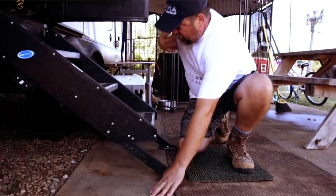Today let's talk about a serious situation we call hot skin. Hot skin is not what you think it is. Hot skin is a situation inside our RV where we have electricity going to the outside of our rig, and if it's touching the outer skin of the rig and we come by and touch it, we can get shocked. What if the RV skin is made of fiberglass? Well, fiberglass is a resistor — it's going to be the metal parts on your RV. Anything that's metal: the steps are metal, the frame is metal.